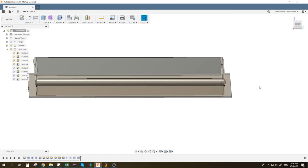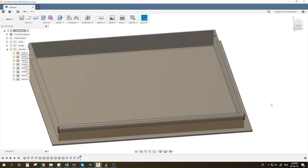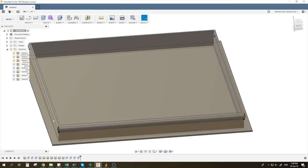However, obviously, if I try to slide this into the inspection hole, what's going to happen is that those cannot bend inwards because they're all connected. So in order to minimize waste of material and also have it as easy to slide in as possible, what I need to do is just remove a lot of this material and just leave 2 hinges on each side, which should give enough rigidity when it's in place. And also it's a good balance of very little material waste.